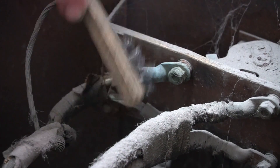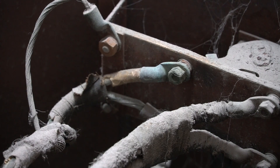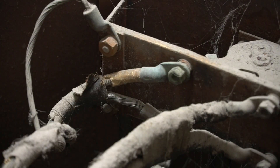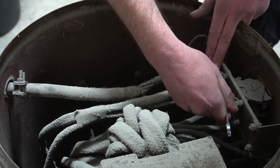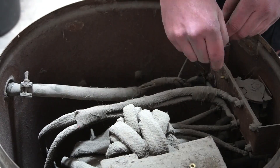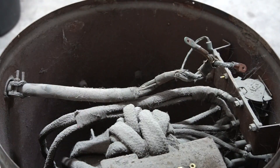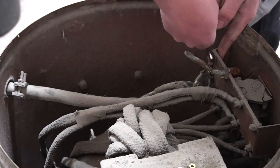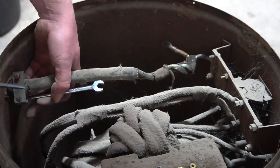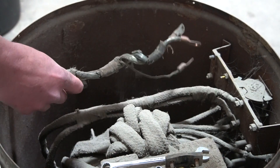Starting with just a little wire brush rather than an air tool, I need to identify which colors are which because all of the copper is now weathered out and corroded. Looks like the white wires are on top, the ground is way off on the side, and black would be down below. A quick picture on my phone will help me remember that. Then I can remove all of these — and it's really unique to find that these are all brass terminals. That's actually really cool. I took my time getting these out, not trying to rush, as they might be corroded and likely to break. In no time, the cord comes right out.